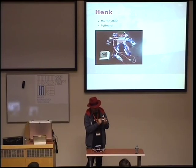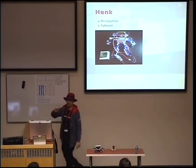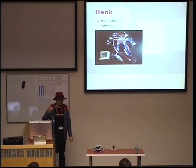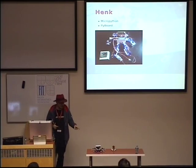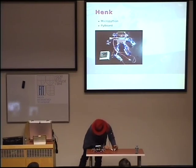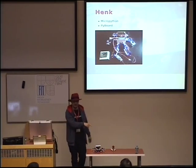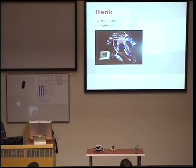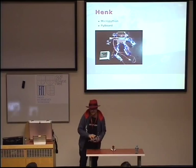And this one is using a vocore, which is basically someone took a chip from a router and put it on a very small board with GPIOs. So it actually runs OpenWRT Linux. And it has USB, so I attached a camera module from a laptop to it. So it has a laptop camera on it. And let me see if I can stream some picture from it. In a minute, it boots. It's a slow CPU, it boots Linux, so takes some time.